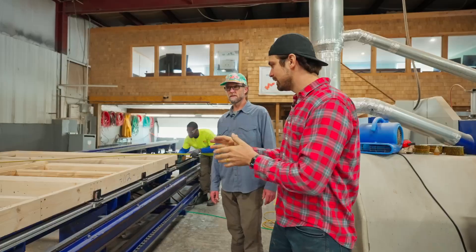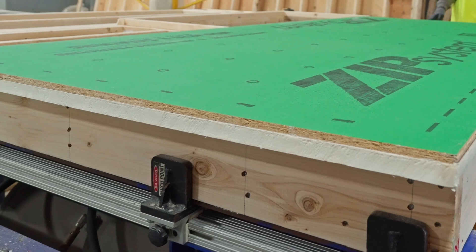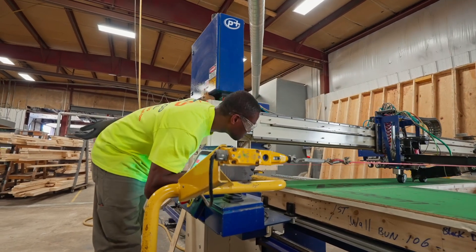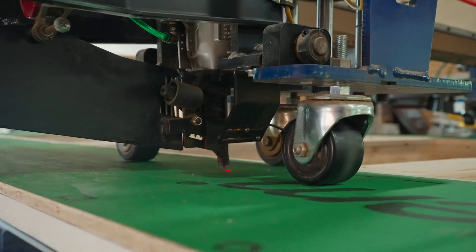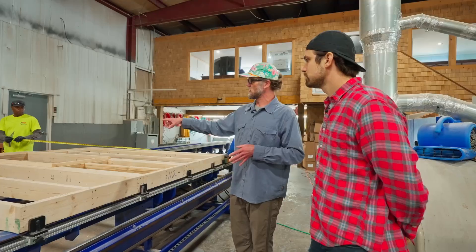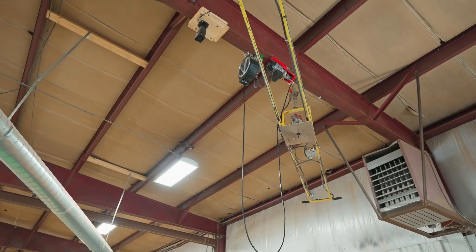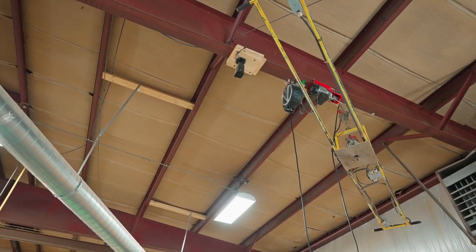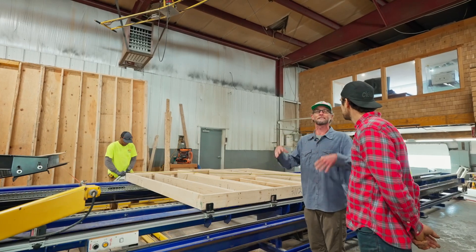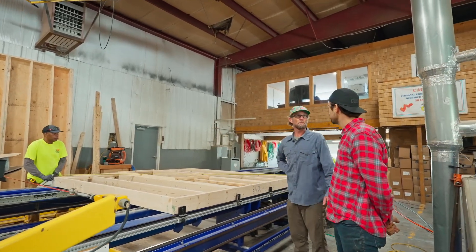The pre-assembled wall unit has lines marked on it because there's a laser on the sheathing nailer. After the sheathing is on the wall, you line up the laser on the line, run the sheathing nailer across, around and back, around all the openings. For panels with window bucks, rather than just laying sheathing over the windows, there's a router that drops down so workers can rout out the window openings precisely. There's also a camera mounted up here because in Massachusetts there's a required sheathing inspection — since walls are produced in a facility, there has to be documentation that they're being nailed properly, covering amount of nails and placement.